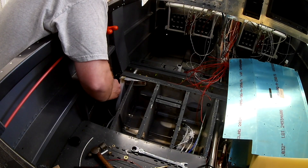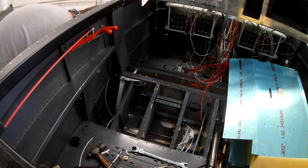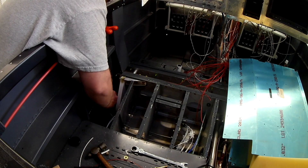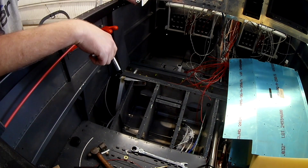Getting the two brackets on — the vertical one's really not too bad. I think it's two AN bolts or three bolts that hold it on, and then you've got the big one that holds it up against the wing box. You've got to torque those on, and they're pretty simple.